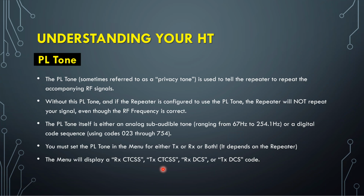I know in Minneapolis, when I go there, they do. I'm a member of a couple clubs in New York. They have repeaters like that all over the US. That's a possibility. But if the repeater is sending that out, your radio will probably still receive it, because if your radio hasn't been set for receive tone, it's going to receive all. If it's turned off, you should still hear it, because you're receiving all. If it's turned on, you're only receiving if it hears the tone.